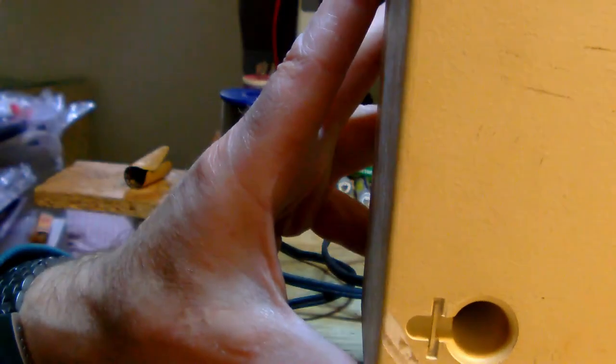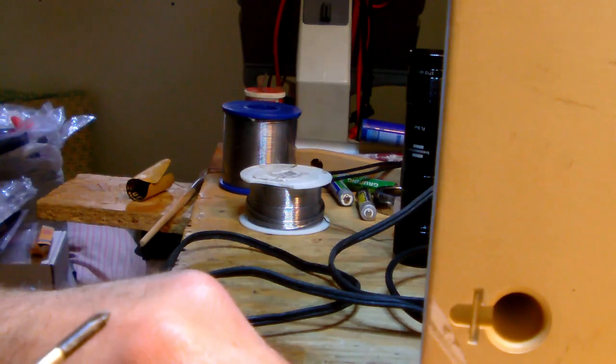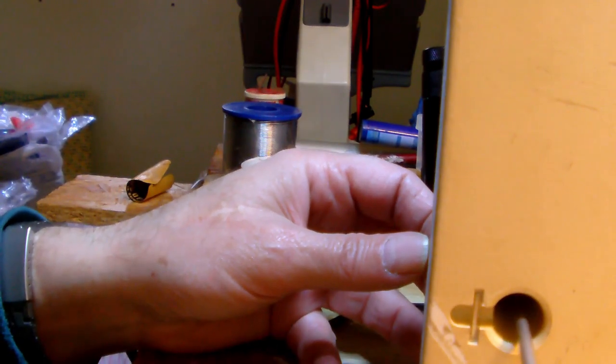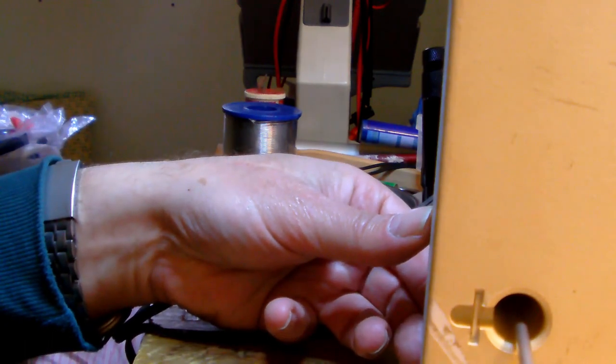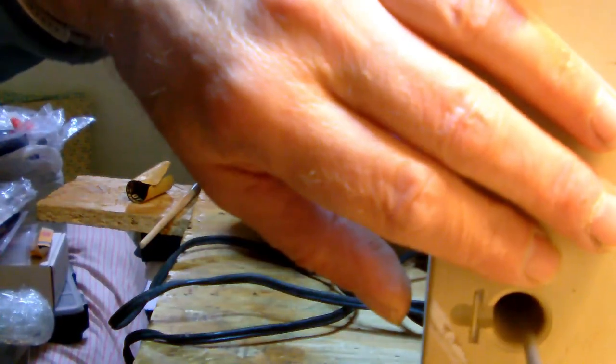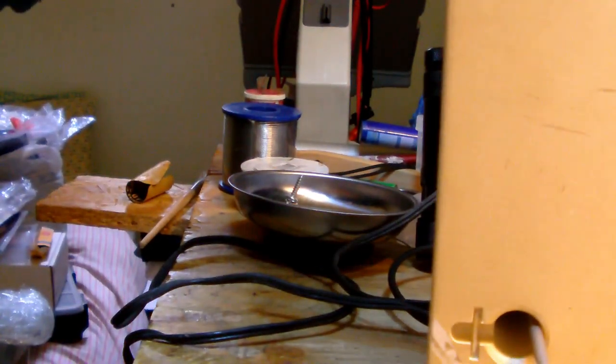And when you poke gently inside the screw holes at the back of the case, you can actually push the front of the case out. I'll show you what I mean by that. Right here you have the upper right hole. In any case, you shove the long screwdriver right down into the hole where the screw normally sits, and then you give it a gentle push, holding the whole outer case with your other hand. And normally what you should see happen is this.